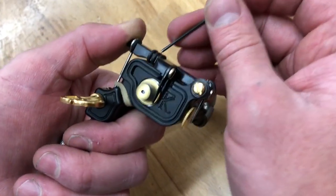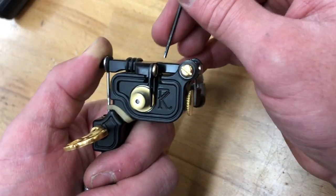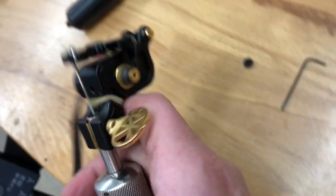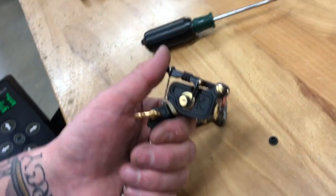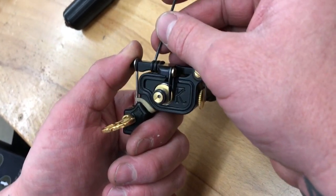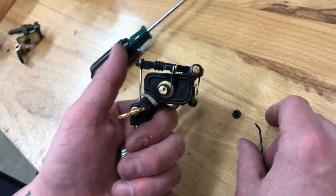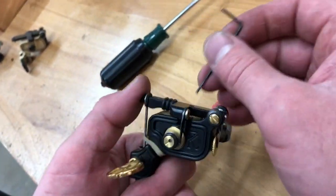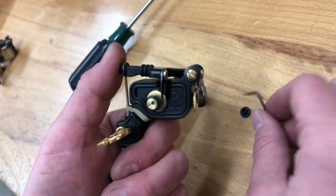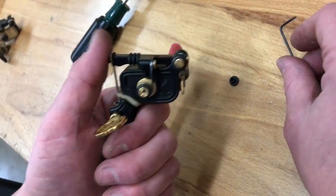Ideally you want the o-rings to dampen the sound and everything just a little bit, while still having the impact screw just barely hitting. That's going to make it so your impact screw won't wear out or settle into the frame as fast, and you're also not putting a ton of strain on the o-rings — so they work together to make each other last longer and stay in tune longer. If it goes out of tune, you'll know because the machine just got a lot quieter, and you just do a very slight turn until you hear that impact at the desired voltage.